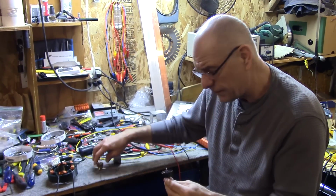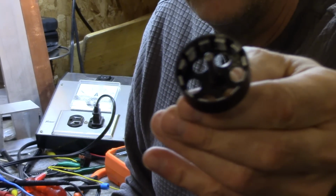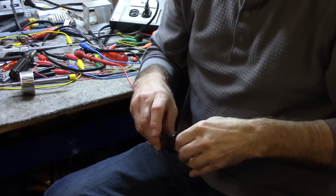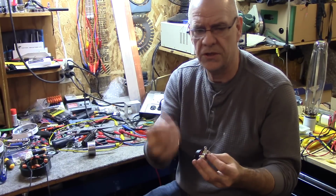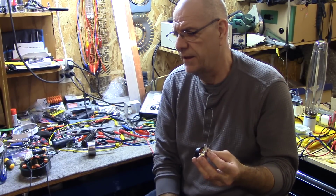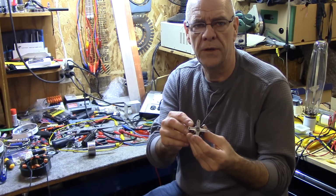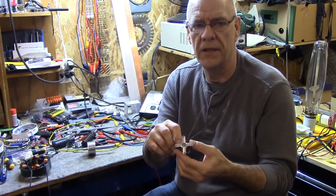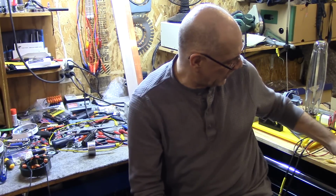And the magnet was inside, because someone also asked me how to remove the magnet from those little drums, or any drum. You just use a heat gun and heat up the outside of the drum. The glue is almost like latex or clear enamel, I think, which they use for gluing those magnets. So with a little bit of heat, the magnet comes out easy. Putting them back together in the right selection takes different tricks. It took me a little while, but it works out really well.